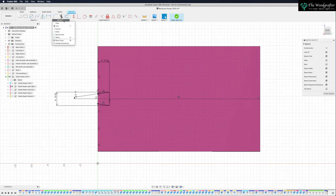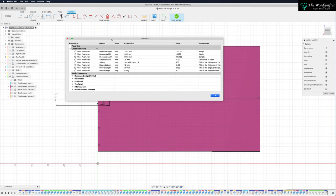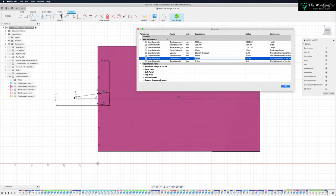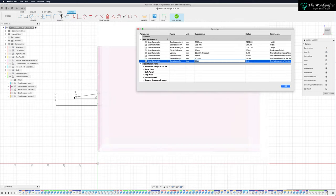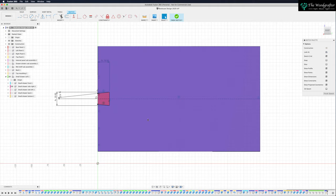Come back into Change Parameters. I now don't want my dovetail to be 20 millimeters — I want that to be 10 millimeters. Watch my sketch — bang, that's changed to 10 millimeters. Undo that. Let's try a different angle — I want something shallower, like six degrees instead of eight. Bang — that's now changed to six degrees, a much shallower angle, fantastic for hardwood. Control Z to undo. So we now have a sketch of a dovetail that's fully constrained with parameters, and we know we can change it by changing the parameters.